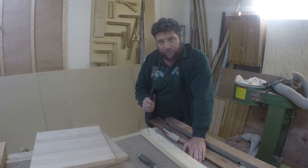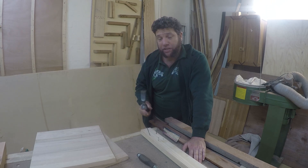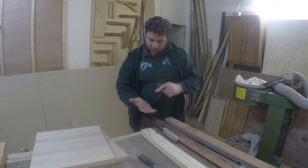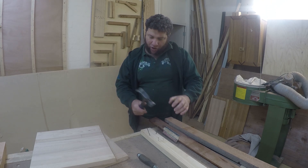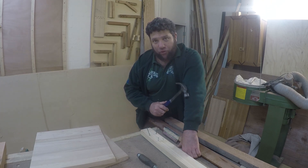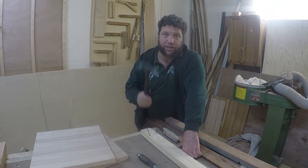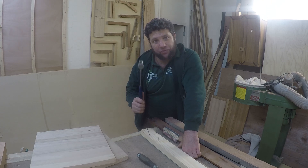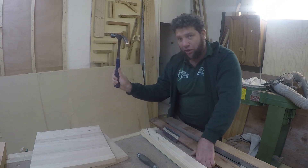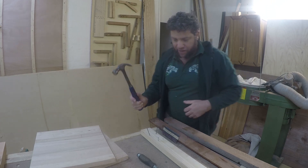When we look at a hammer, it doesn't so much matter on the size — it more matters on the grip. I learnt this from a Japanese guy many years ago. He was an expert in Kenjitsu, which is a sword art of Japan, a samurai sword art. He would tell me to use the lifeline of your hand against the edge of the hammer, pinching with the bottom fingers, with the back finger as a steering rod. Much earlier, when I was about 14, I hung out with a cabinet maker, Mr Mills — a legend in joinery. He taught me something very similar: steering with your thumb on the back of the hammer. Your thumb doesn't have to go directly on the back; it can come around the side slightly. What it does is it holds the hammer into position in the palm of the hand, and I can't stress that enough.